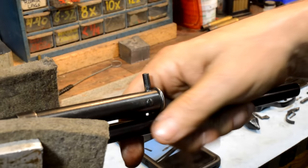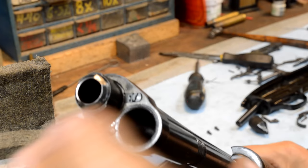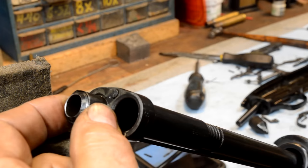So now we've got the entire front end of the gun put together. We've got all of this set up, and this is the takedown part right here. While we were messing with this, there's a gizmo right here, and Bruno's gonna reline this for me. That gizmo right there, when you pull that screw out, that three tooth unit comes out and it allows this to rotate slightly. This is how you set how tight the front end of the gun is. It was right, it's not a moving part. I didn't mess with it during this conservation, and I recommend you don't either. If you need to tighten one of these guns up, that's a little beyond this video.